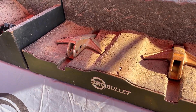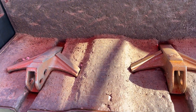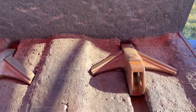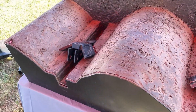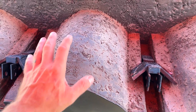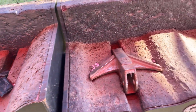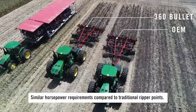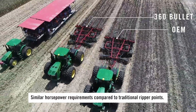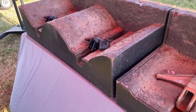Our last fall product is our 360 Bullet Points. A big question I get is do they pull harder? This is obviously a wider point than a lot of the traditional OEM ones out there, and we are doing a lot more work. If you move all the loose dirt out behind your ripper using OEM points, you're going to have a hard berm in between the points. With our 360 Bullet Points you can see we are basically eliminating that berm — so yes, it is going to pull harder, probably five to ten percent harder, especially that first year as we're breaking up that hard compacted berm.